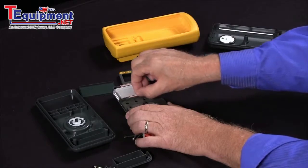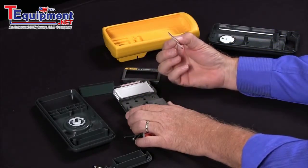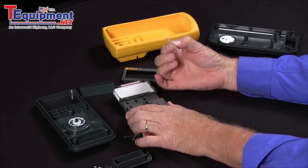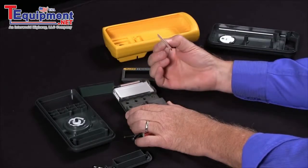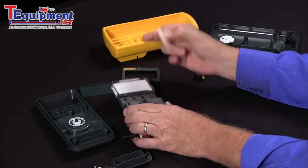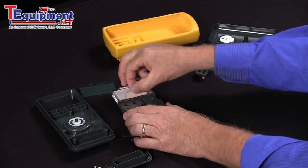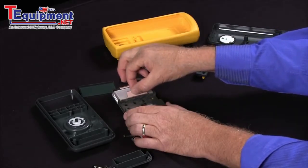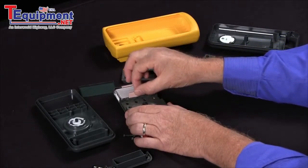On the newer 87s, we actually redesigned the elastomer strips so this would not happen, but every once in a while it does. It's a matter of just getting these elastomer strips out and cleaning the contacts, because these are the contacts that connect between the circuit board and the display. Once you've cleaned off the circuit board contacts, these just slide right back into their slot.